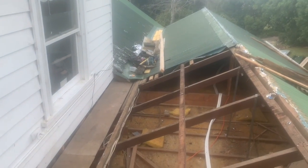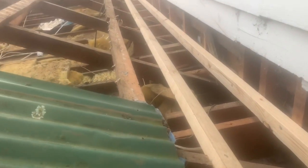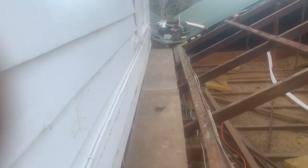I'm getting a bit tired. I've got some of the gutter board in. The technique I'm using is just the board up against the building on the right-hand side, leveling across, putting the second board on, screwing them down. And then I've got some 20mm plywood — which is well strong enough — sitting on top of those two. I'm running out of time so I better get stuck back in.